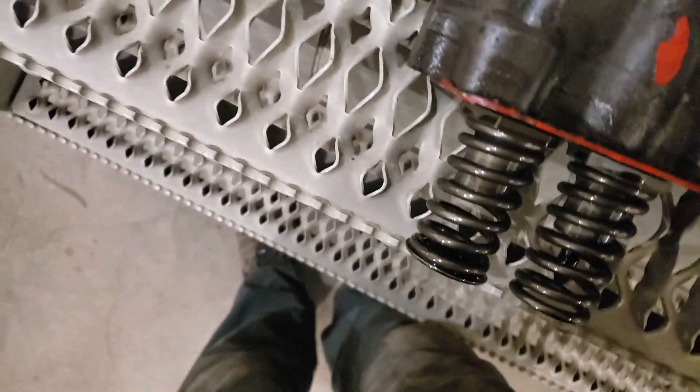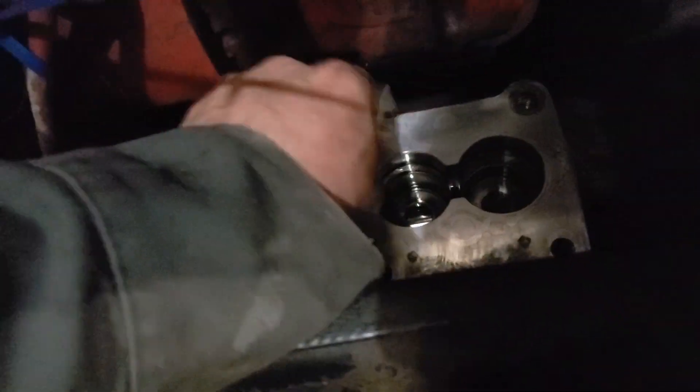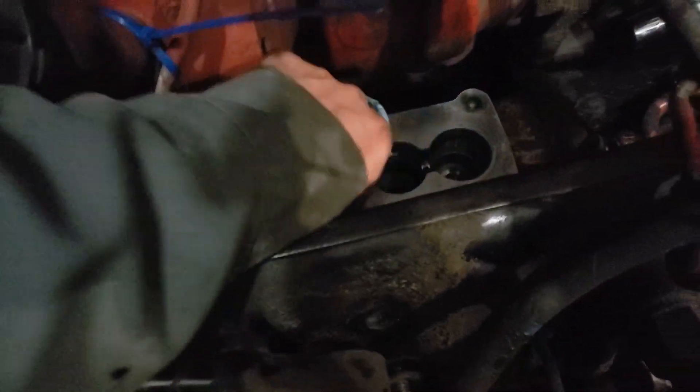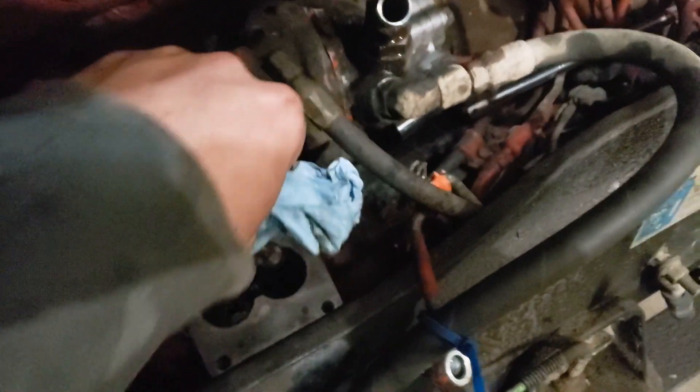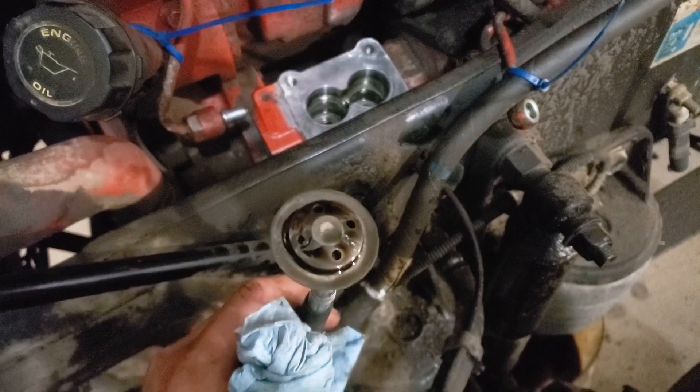Here you can see the whole assembly — gives you an idea of what it looks like and what you're taking off. If you look closely you can see that one spring cap has fallen and stayed inside, but we'll fish that out later. You can then clean up the deck surface on the base of the unit. I just like to use a razor blade and scrape it nice and smooth to get all the debris off, then clean it up with a little bit of brake clean on a rag and wipe it clean. Just use a magnet and fish out that spring follower — it rides on the cam in the base unit. Make sure you don't leave those behind because you will have catastrophic failure if you forget one.